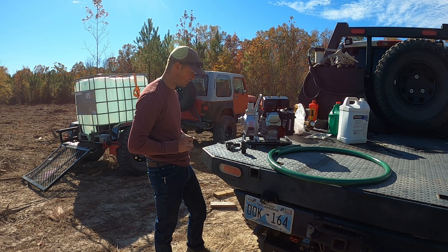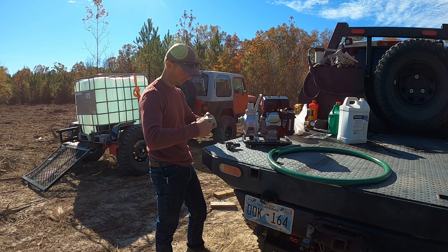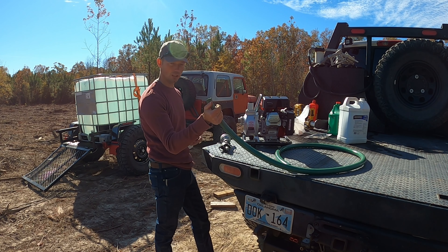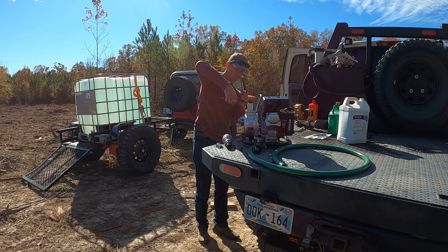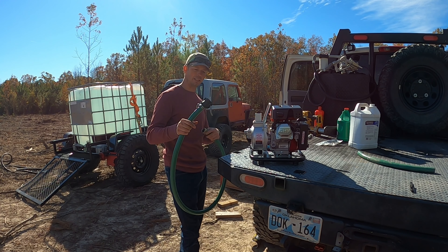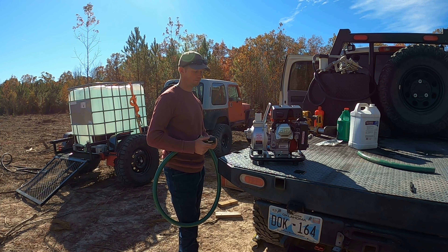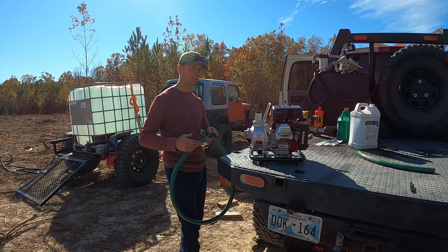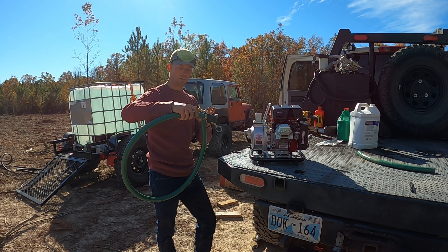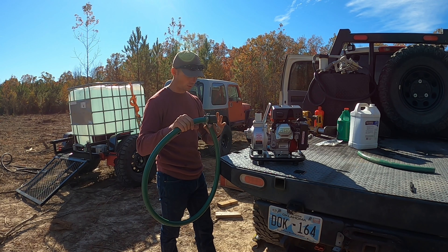We had to go galvanized to neck down from the tank because it's a two inch national pipe thread NPT down to one inch. We'll have this reducer on the tank, then this suction hose — you have to use a specific suction hose. We're going to go with cam locks on everything we'd need to hook up real quick or take off one thing and put on another, instead of sitting there threading things in a hurry. This is the suction hose — it's specific because it has structure to it, like a plastic coil inside of it.